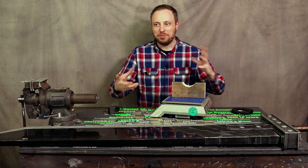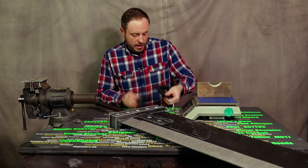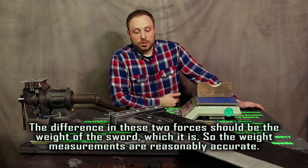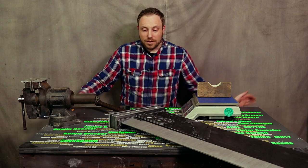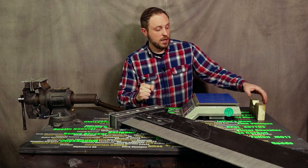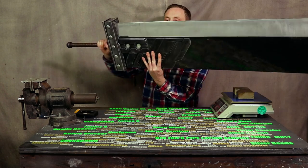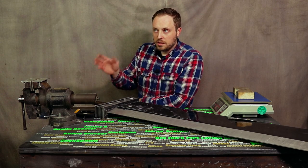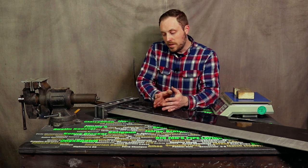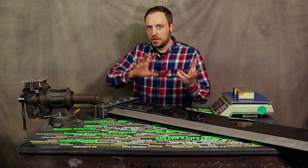I came up with a way to give you an idea of what it feels like to hold this thing. The scale has been zeroed for this piece of wood holding the handle where my hand goes. It's supporting approximately 26 pounds, and this is at 15 pounds. So even though the sword weighs 11 pounds, you're putting 40 pounds of force into it just to hold it out straight. What really matters is the moment of inertia on a sword, not its overall weight — which is why I made it heavier, moving the balance back. I'd like to show the torque it puts on your wrist one-handed, but this scale only goes to 30 pounds. Even though the balance point stays the same, as the two points you're hanging on to move closer together, you have less leverage and perceivably more force.